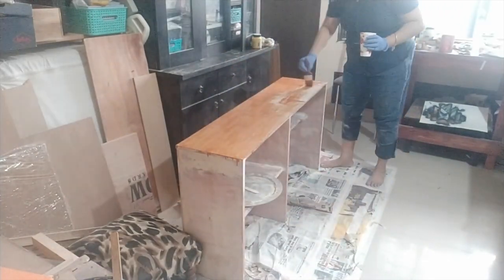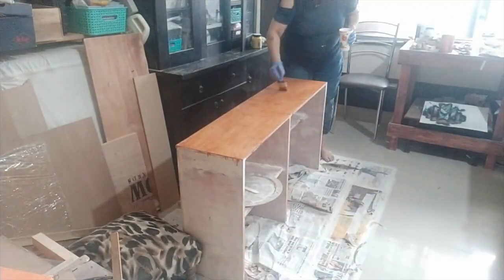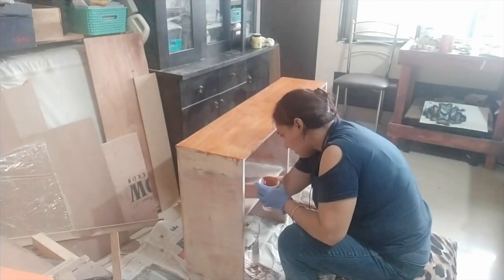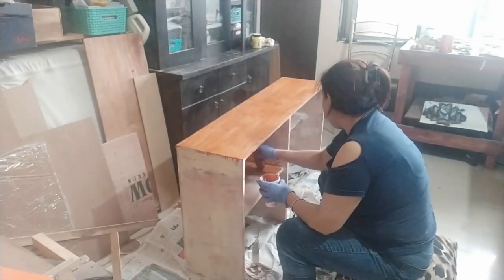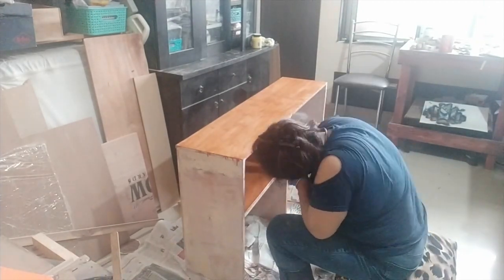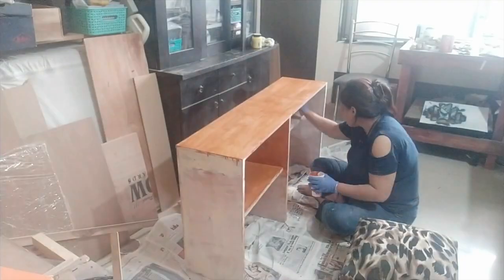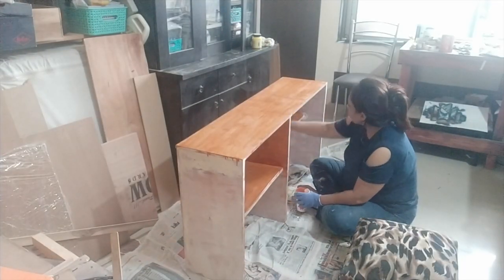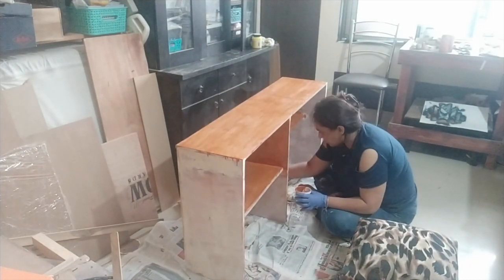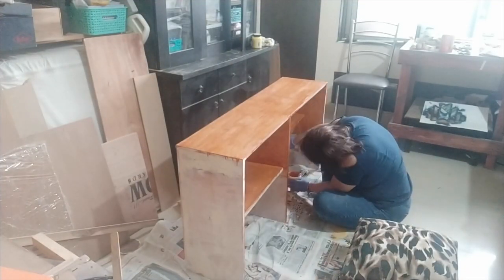Here you see me mixing the paint. I used turpentine oil to thin down the paint. My coat is intentionally uneven because I wanted a wood-textured look — I wanted to create grains in this plywood, which doesn't really have grain. I added some black enamel into the golden-brown enamel to create dark areas and light areas, mimicking a wood grain look. This is the first base coat.